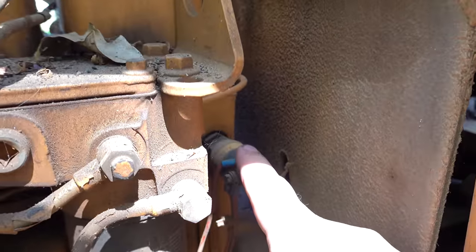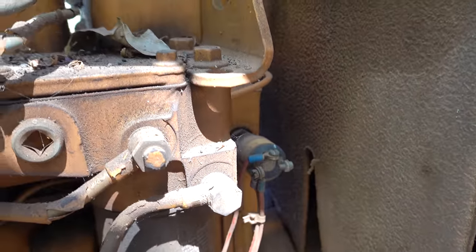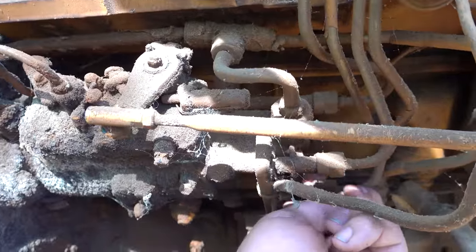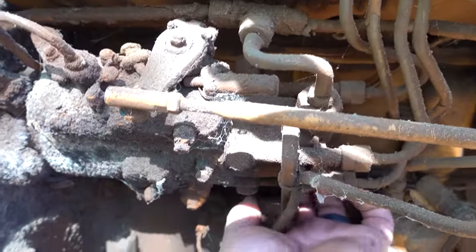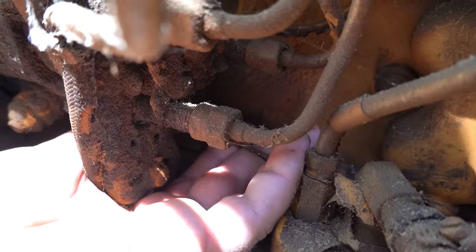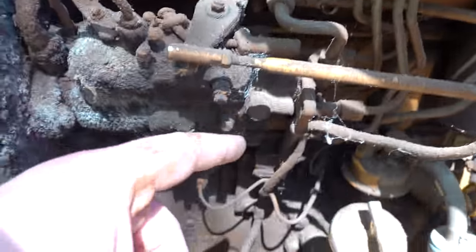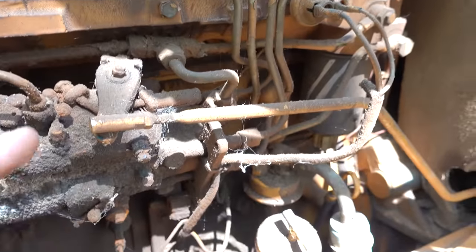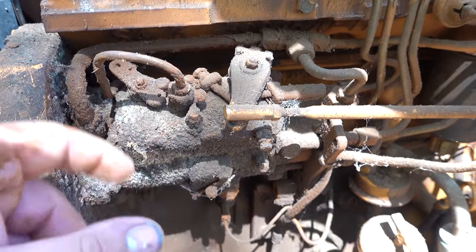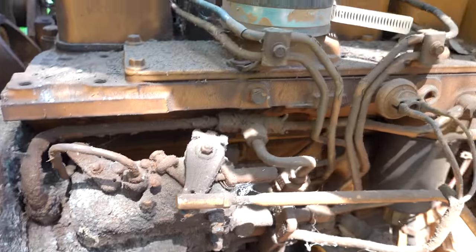This, I think, is the oil pressure shutoff valve. I don't know, you guys will tell me. But what that means is we should have a single wire fuel pump shutoff, which I feel a wire. Yep, so under there, you can't really see it and I won't be able to show you. It's going to be our fuel pump shutoff solenoid, which just needs 12 volts on one of these. Pumps are three wires and I have no clue how to wire them.